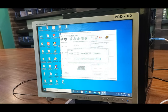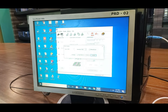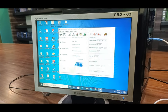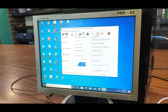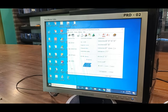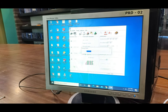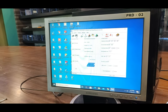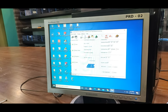If you find a timeout error, press reset again and quickly press Connect. This may need to be done three or four times to get a proper connection, because the RAM memory has some internal register values that need to be satisfied. After a few tries you can see the IC has communicated — COM3 at 9600 is showing connection. The file is already in the buffer, so press the Run button to program the flash: it will erase flash, check blank, then program. Verify Pass confirms the program is completely downloaded to the IC.